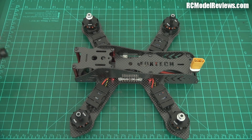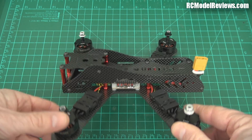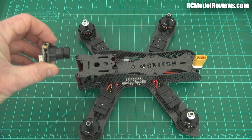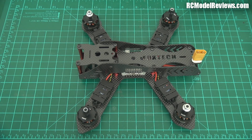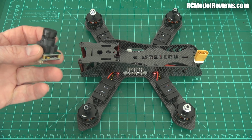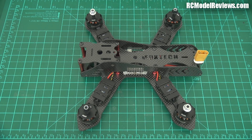Installation is obviously very simple. One thing I noticed is that there's only a fixed angle for this camera plate, but that's not as important as you might think because this has a 2.1mm lens. A lot of people are going to 2.1mm because it's a wider field of view, so it gives you the freedom to use the same angle for freestyle, racing, whatever — because the horizon is always in view even with a modest amount of tilt. In fact, I might do a video on switching cameras to 2.1mm lenses if people are interested.